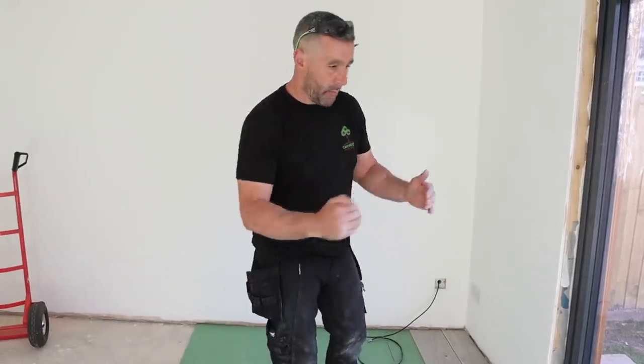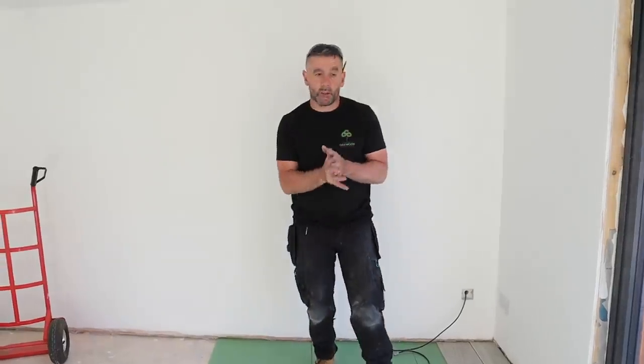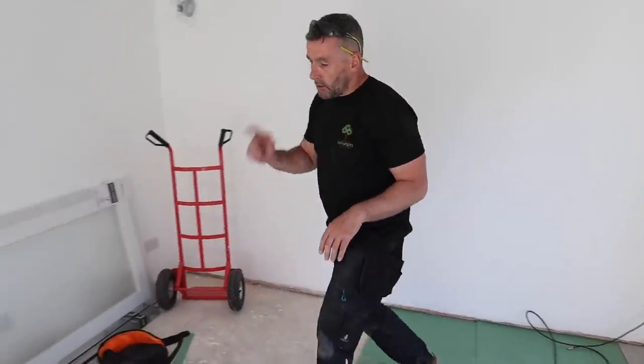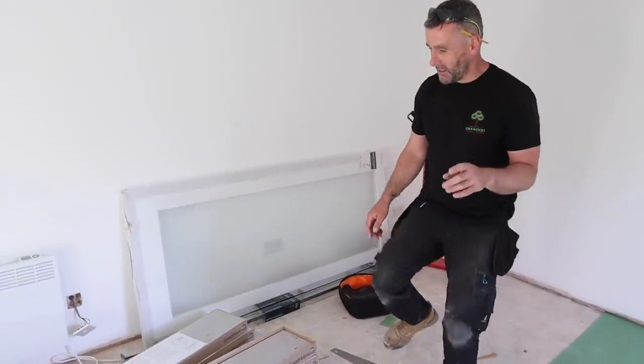I know it says to use packers and pack it off, but you don't need to, because laminate floor these days is pretty well clicked together and it works pretty well. So we'll use the weight of the laminate floor to hold it in place. We'll shoot through the tool there, and just another point, I'll tell you in a minute what happened as well, this will make you laugh.